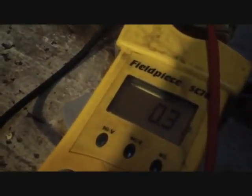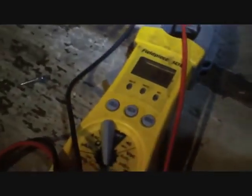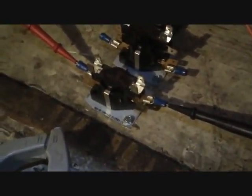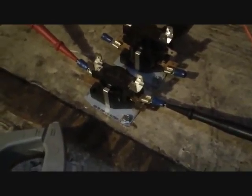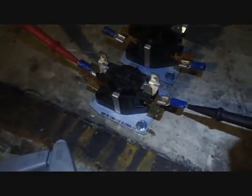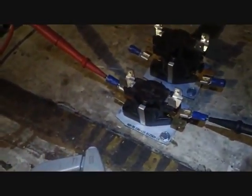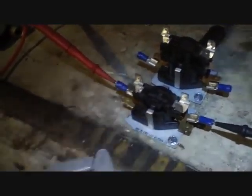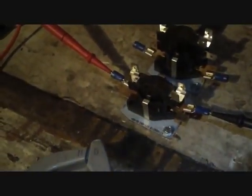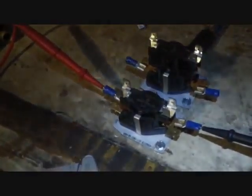The same way, sometimes relays won't close and they'll never come on. Let's take a look now at the coil and how we can troubleshoot that. I hooked up my 5KW sequencer — I have a little demonstration here. We can see that our resistance across the coil is 75.1 ohms, which is pretty typical. So if you were to get a really low resistance, you would know the coil is shorted, or the strip is shorted, or there's a problem inside. If you get a resistance that's extremely high, you know there's a problem. You can take one of the ones out of your truck and see what kind of resistance you get, and use that as a benchmark for your other similar relays. A lot of them will be very similar in the 65–75 ohm coil reading.